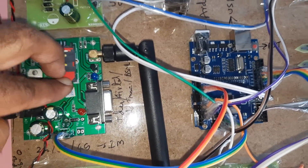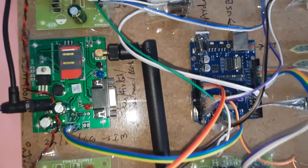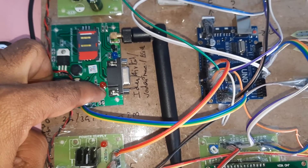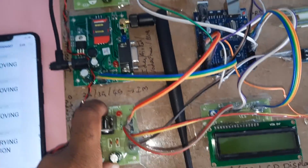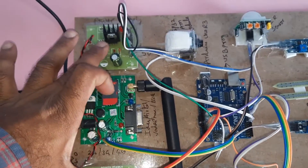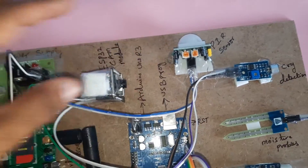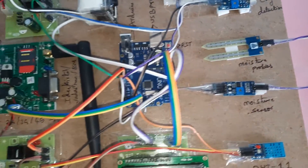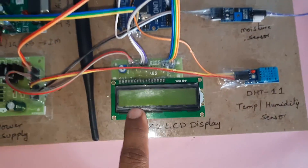The SIM card is a lock/unlock type — slowly press and insert, then press down and lock it. There is a bridge rectifier, filter capacitor, 7805 regulator, and LED for the power supply. There is also a GSM SIM 900A module with its own power supply. We are using two power supplies because there are a large number of components. The ESP32 uses one power supply, and the Arduino, LCD, and other components use the other.